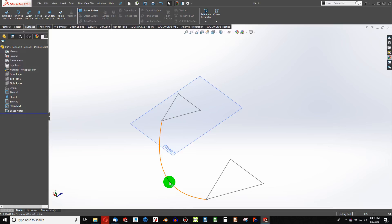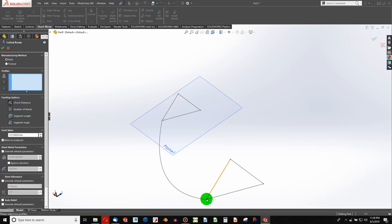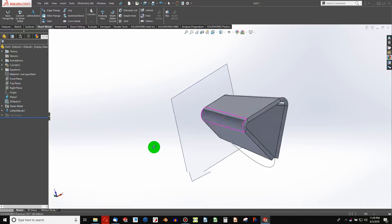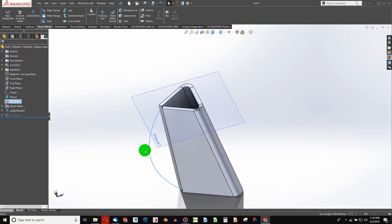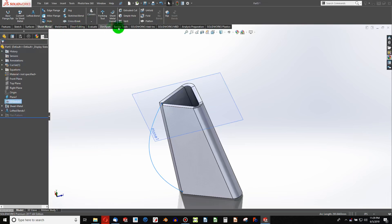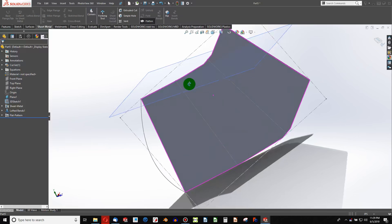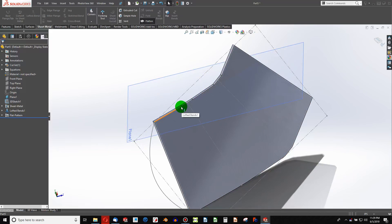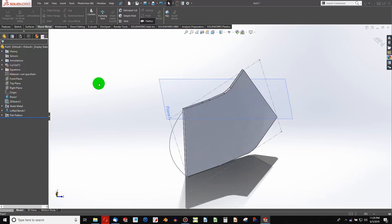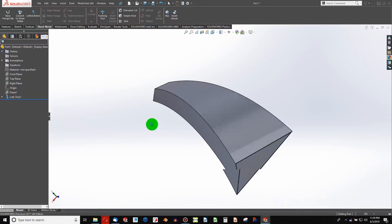A final option - the fundamental problem is this guide curve right here. Of course, I can run a lofted sheet metal from this profile to that, and of course it can flatten out. But I don't have that bend there - it's the guide curve that makes it impossible. So your next option is to run a lofted sheet metal surface and being able to flatten it out is quite easy. You can do the loft without the guide curve - you lose that intermediate bend. So those are some options in dealing with the problem of trying to do a part like this in sheet metal.